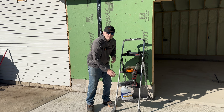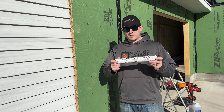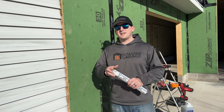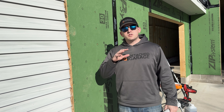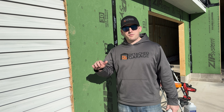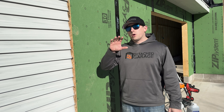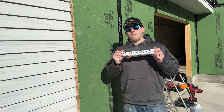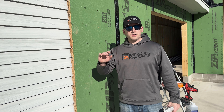I'll put all the links to these products in the description below. Let's talk product specifics. This is Blue Barrier gap filler. The really nice thing about this is we're in Wisconsin — it's about 37 degrees today — and this can be applied down to 25 degrees, which is great for winter applications. You'll want to store it above 40 degrees, though. This cures once it hits air, so be sure you're capping your gun when you're done and not in use.